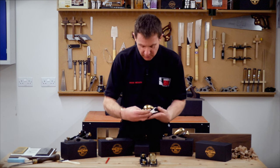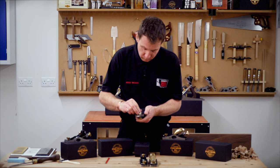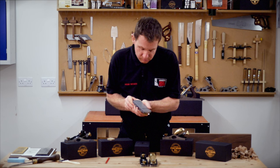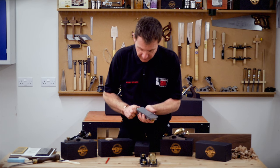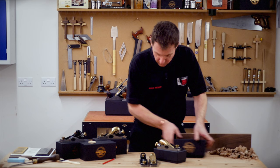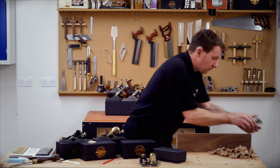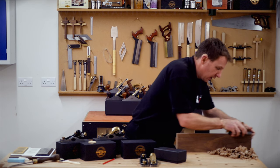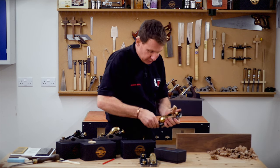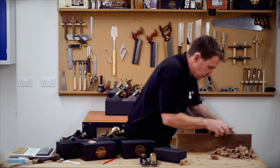Set up and locked. Cutting on one side, not quite cutting the other side. So again we have lateral movement — we have a lever, lever to the side. Still cutting a little bit on my right hand side, I'll adjust that. Feels better. So let's just move these along a little bit, make a bit of room. You can obviously plane with the grain. Gently bring the blade forward, find our cut. We'll cut down the grain nicely, just come back a little bit. That's good.